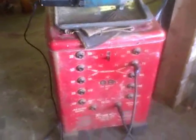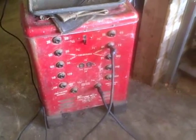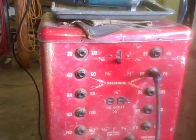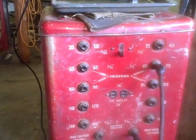That is our welder, by the way. I know somebody's probably going to comment and tell me I'm wrong, and if I am, I am — I'm more than happy to admit it. But my understanding is that's a late 1940-something Forney arc welder, just an AC current. Pretty simple machine, but it works just as good as anything anybody around here has. It can be a little bit hard to get it to strike an arc sometimes, and it's not real stable on low voltage, but it's a good machine. Does the trick.